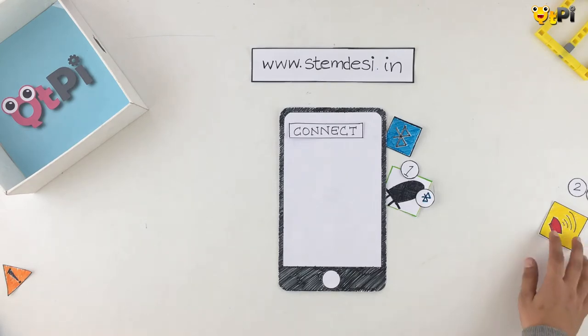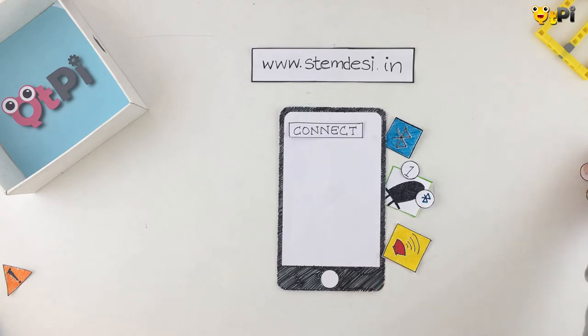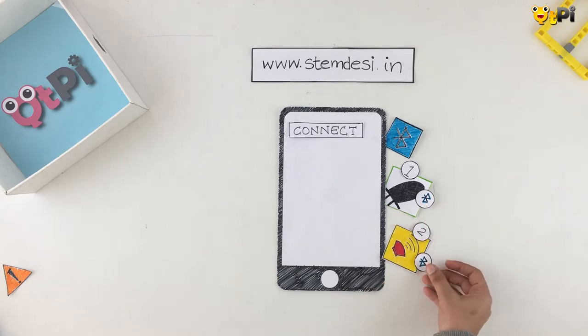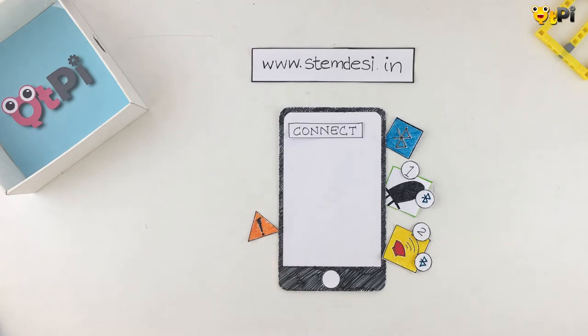Once you've done this, add another QtPi mega block, the buzzer. Assign it to port number 2 and give it Bluetooth connectivity. Once you've added all these blocks, don't forget to add the notifier. After doing this, go ahead and program your app.